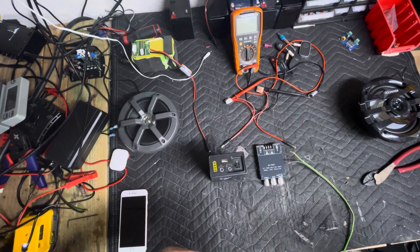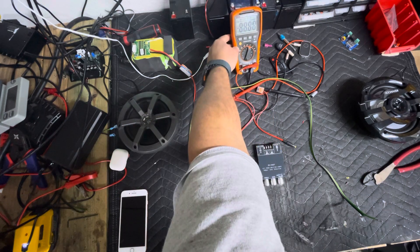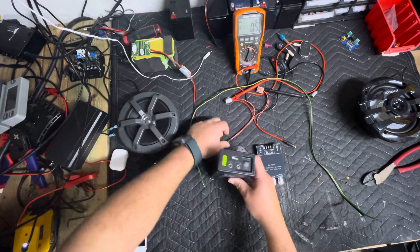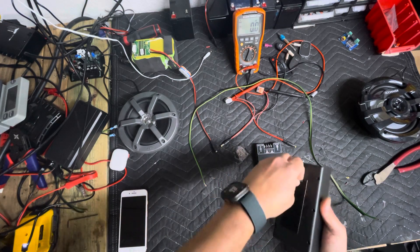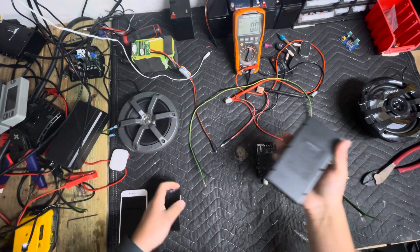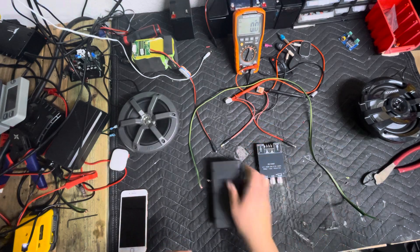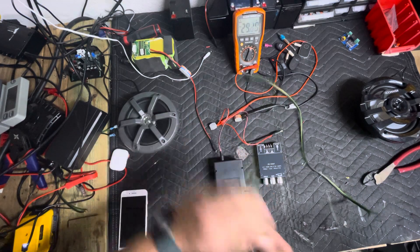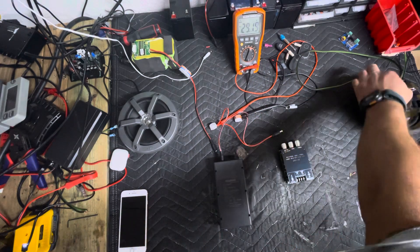Never charge it to full capacity — use a 27 or 28 volt charger since it was good to about 28 volts. Or get a buck converter and drop it down to 24 volts and just stay at a safe level the whole time. That actually gave you a little bit longer run time too. I have my Klein MM600 right here. I'll switch it to DC, turn the Talent Cell battery on. This is the PB240B1 — there's a B2 as well. All of them needed a buck converter for some reason or another. It's reading 29.19 at full charge.